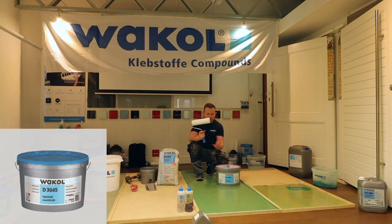Simply 3045 applied on PU280 — that's the reason for the pink color, to see it better when you apply it on PU280, to make sure that you apply a closed film all over, to assure that a leveling compound will stick. I remember I asked the same question: why is it pink? On PU280, which is grayish-bluish, it makes sense to have something you can definitely see.